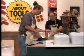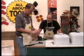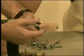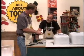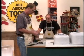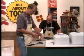And you have to be really careful with this. A couple things that every fabricator had to be really careful with when using these is, one, you always wanted to make sure that you didn't drill all the way through the top. John came up with a really ingenious method of preventing that. The way we did it is we used a hole saw with a mandrel. We had the hole saw cut off, exposing just the right amount of mandrel for drilling with. This is the same process and a whole lot cheaper and simpler than what we did.